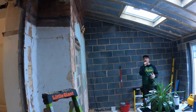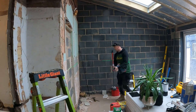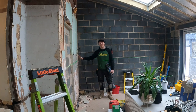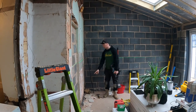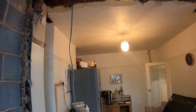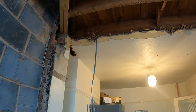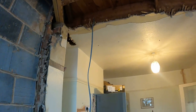So whilst Nick's cracking on with the kitchen - he's got the laser out doing all the worktop work - we've got a couple going in. What we're going to do is sink the boxes to the brick, so I'll just chisel some plaster off. We're going to drop them down and run them low level, because this whole floor has been raised by another 150mm. So what I'm doing is pulling in the old existing cables that we looped up in the floor. This is our end point - I've got three freshly drilled holes. So I've done one for the 6mm - let me just take you through to where we are going.